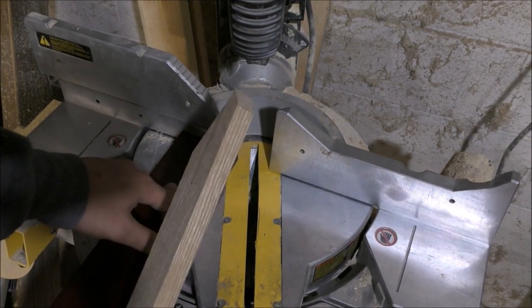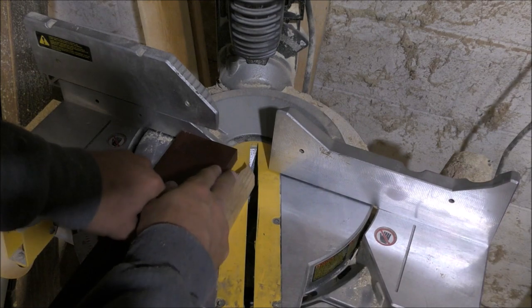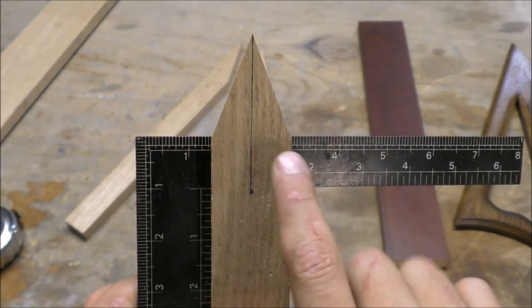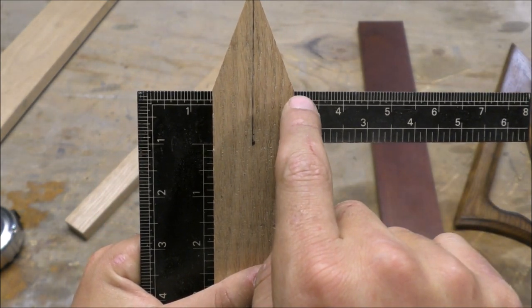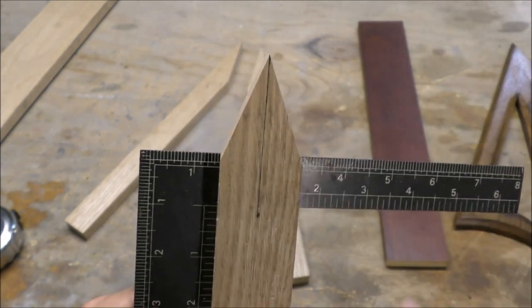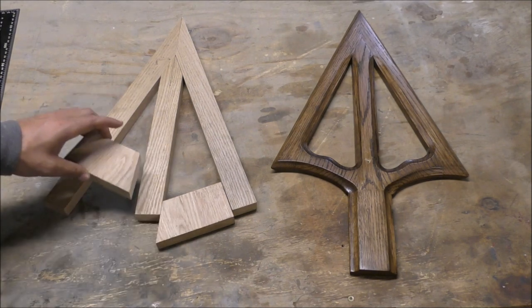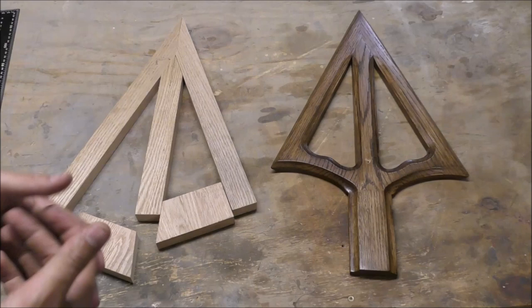I made my first cut and now I've flipped it over and I'm ready to make my second cut. Basically now the center line is my guide - I'm going to make multiple cuts until I reach that center point. I kept creeping up until I met that line, and now these are exactly the same angles and the same size. Another good way to tell is you can take a right angle, lay it along this side, and if these two points intersect the right angle, these are exactly the same length. I need to glue this up so it will not move. Once it's set, I can continue to cut these down to the point where they slip in, and that's where I'll know they're the right size to be glued in.